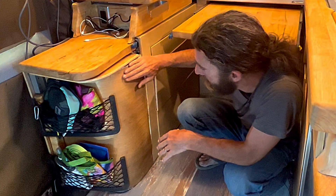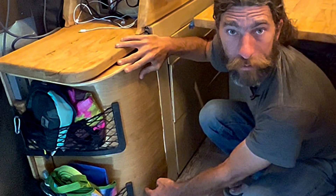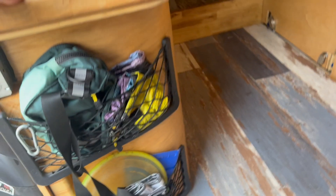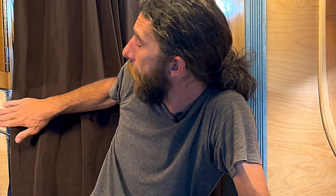The next thing is the wood veneer. I wish I would have used more of it. This is in my kitchen slider area entryway — basically I've got foam that's been bent, and you can put that veneer on there because it's thin enough, like a sixteenth or thirty-second of an inch. It's going to be able to bend with the foam. I use mostly eighth inch laminate on most surfaces, but where I don't need any extra structural strength, I could have done the foam, then the screen, then the veneer, like I have on this curved piece down here.